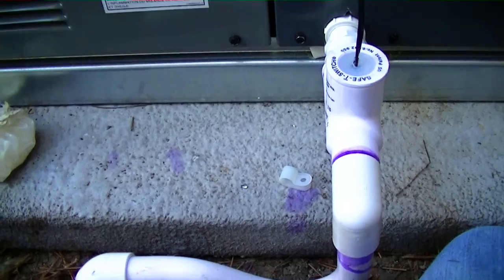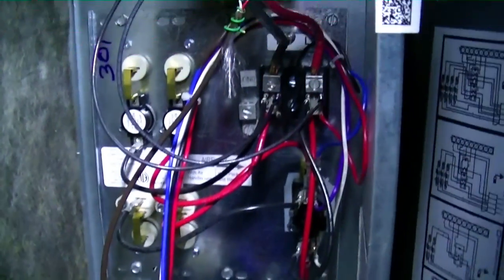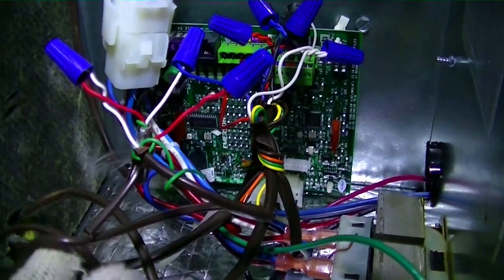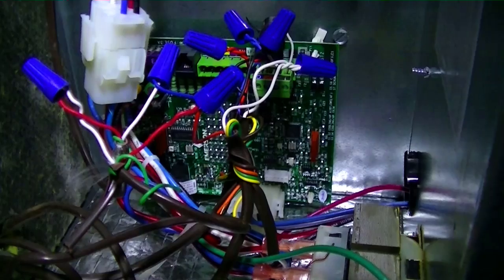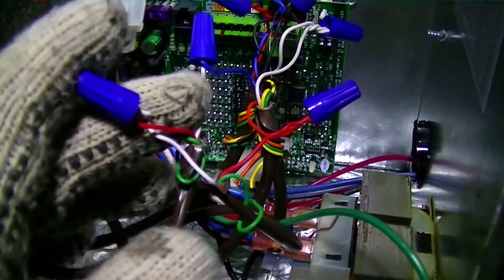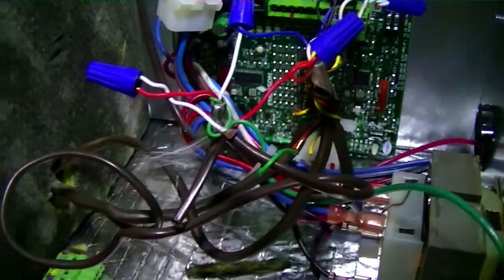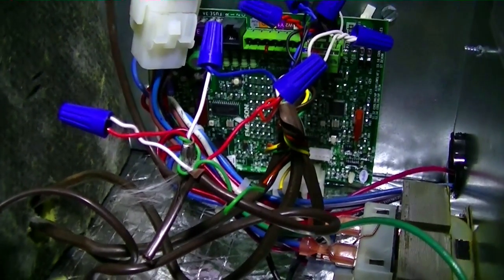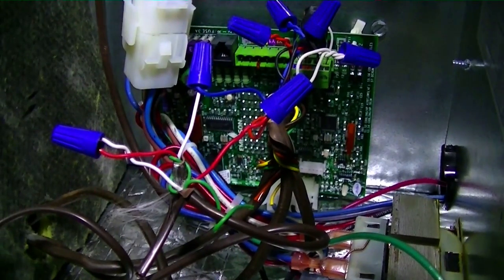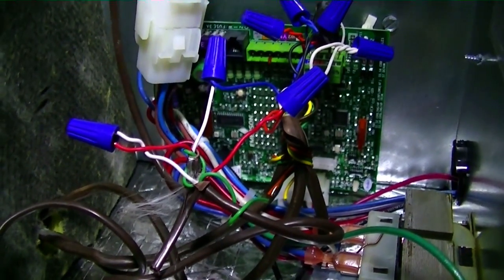I'm about done here for today — I'm going to head off to a service call, no heat. Down in our crawlspace air handler of the four-ton split system and modular air handler, I was coming back to attach my freeze switch and float switches to this system. I had a pretty good idea of breaking the R signal, which is 24-volt hot, breaking it in between the transformer and the outdoor unit, so it will no longer function once one of the switches trips — sort of how the Y1 signal cutting worked on a regular system anyway.